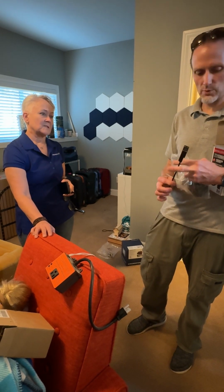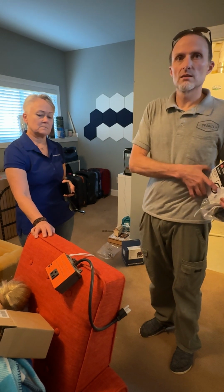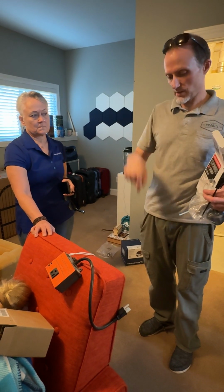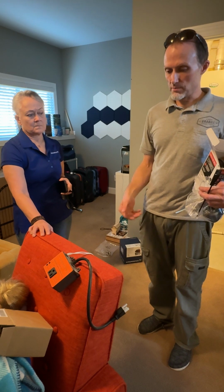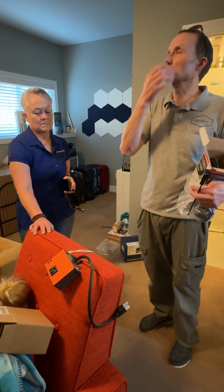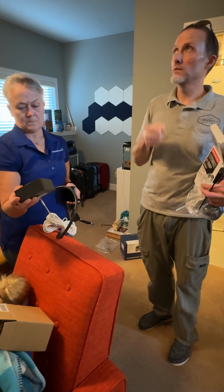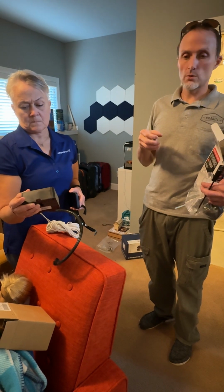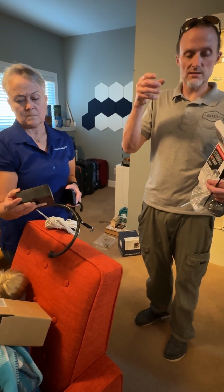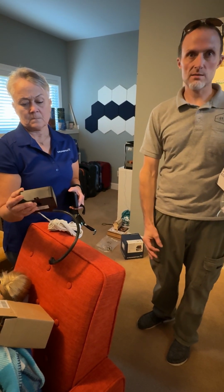But it's a magnet switch, but you would not want the top underwater. Right. Okay. So that would have to go clear at the top. It'd have to go all the way down, and you can let the float come all the way up. Well, let me think about that. When it's up, it's on. So how they work is it'll stay on because it's a magnet. It won't shut off until it drops all the way down and hits the bottom and pops off.